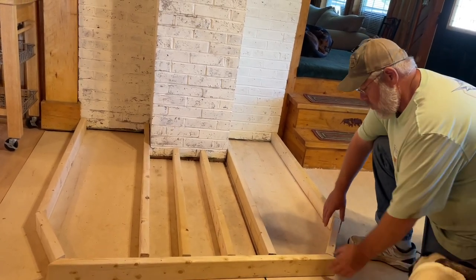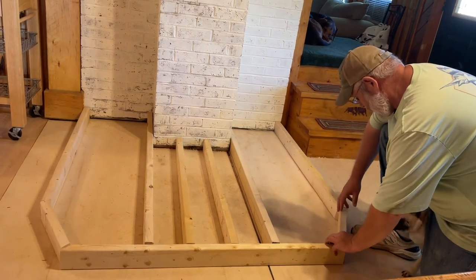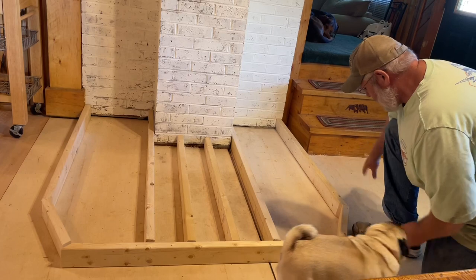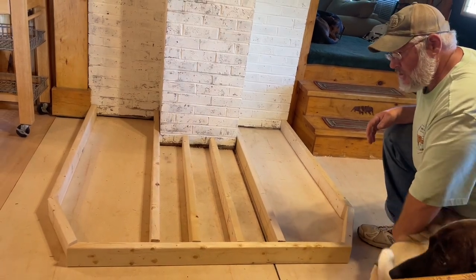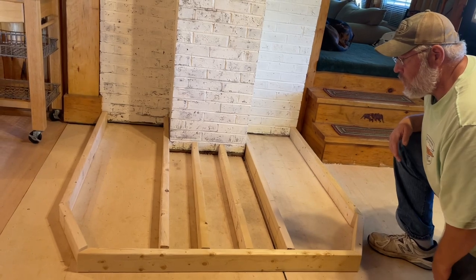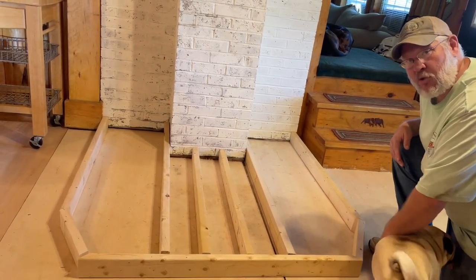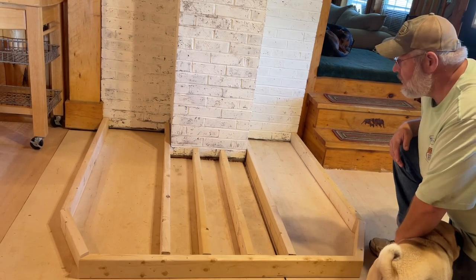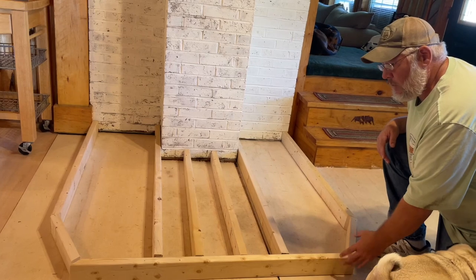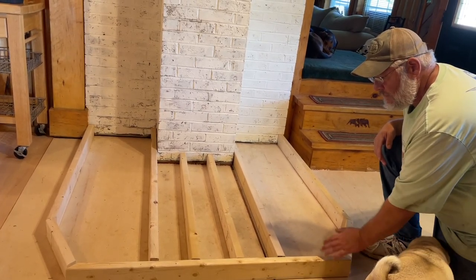So I've angled the corners here just to give us a little bit more clearance around, but so that we have enough room on the hearth for my wife's decorations and any extra wood that we might want to put on the hearth. So we're using 2x4s that'll get us just up enough off the floor, give us a good clearance,